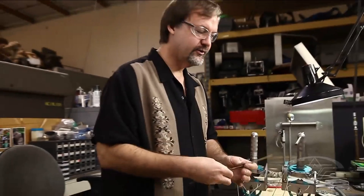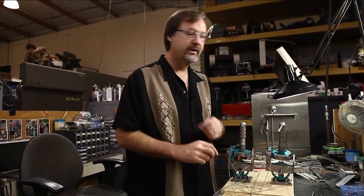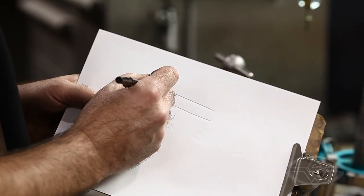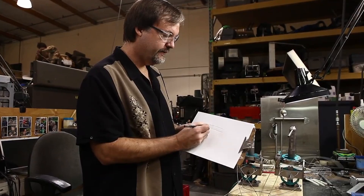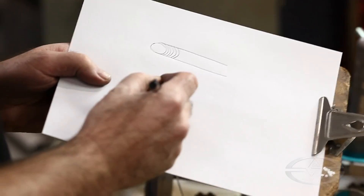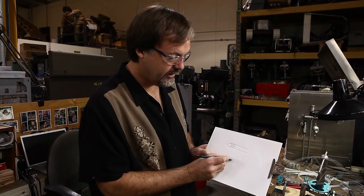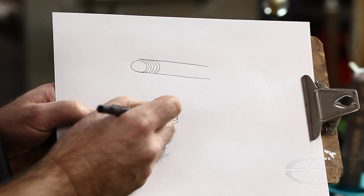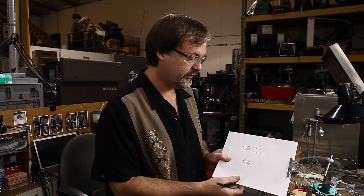So let's go ahead and make a slightly simpler version of that that doesn't involve all of the computer CNC work. Out of just really simple sliced aluminum — I'm going to take just a bar of aluminum, slice it multiple times, probably do a five-vertebrae one to start with. Each one of those slices, all I'm going to do is drill a simple passage hole in the center, then four holes for the four cables, and then in the side I'm going to drill and tap a hole that's going to actually create the vertebrae we need for this tentacle project.